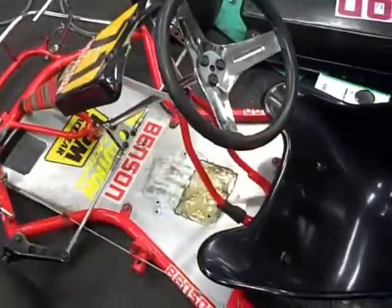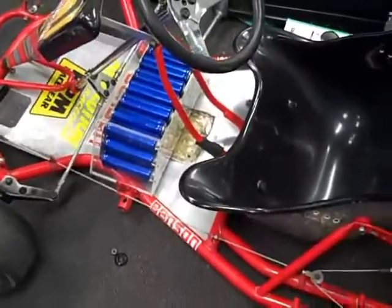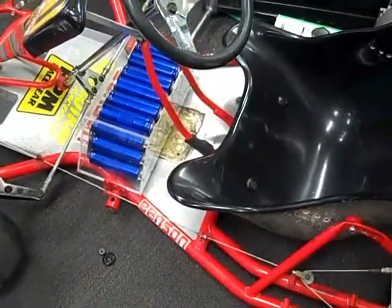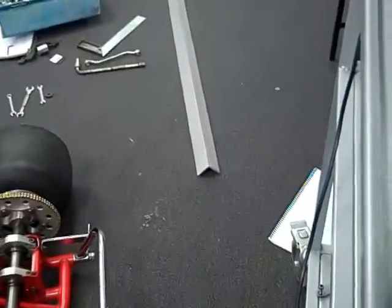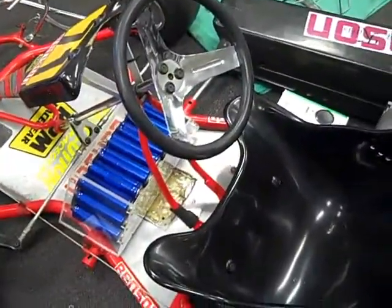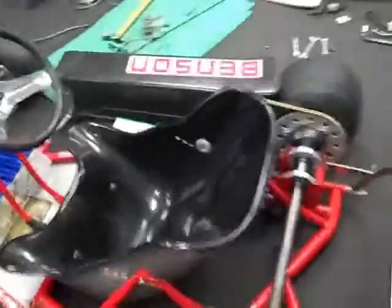The next pack goes up the front. The second pack sits up here at the front. We're going to be putting more angle around that to support the pack and to secure the perspex, and it will sit down nice and snug within the aluminium angle and bolt down. We've got some aluminium angle and we're going to cut that up into a little battery box, and all the little batteries are going to be nice and snug in that battery box - we might even clamp them down from the top just to make sure. We've left the top exposed so we can allow cool air to go in and come out of the battery box. It's a first attempt, and this little go-kart should be quite good.